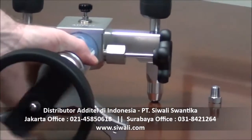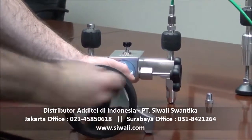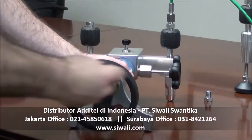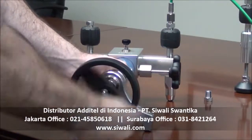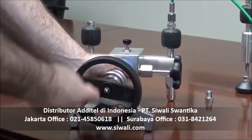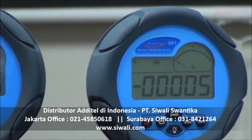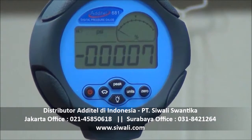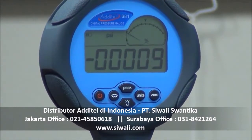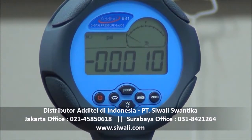Then I'm going to go all the way in. Now I'm going to close and pull it out again, and then we'll open it back up to zero the instruments and then we'll generate pressure. When I'm doing this, I have that vent valve closed — that's important, because if I leave it open, I'm just bringing air into the system. We don't want to do that; we want to get rid of the air.